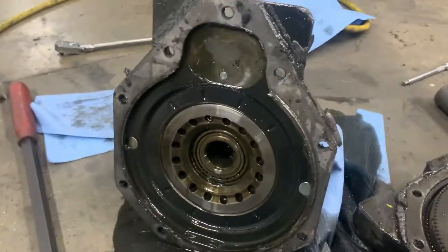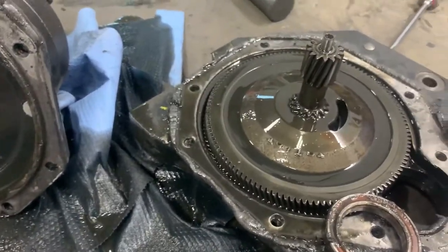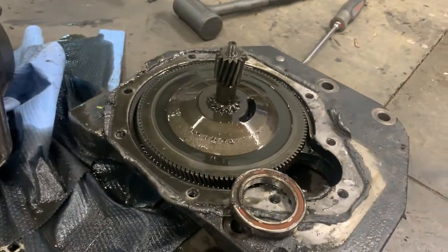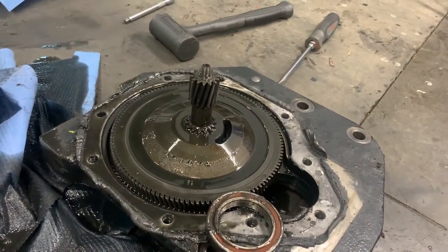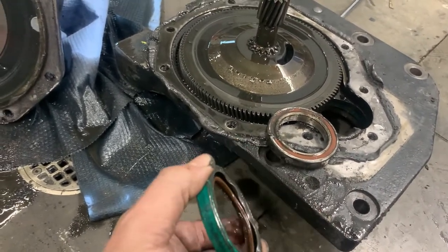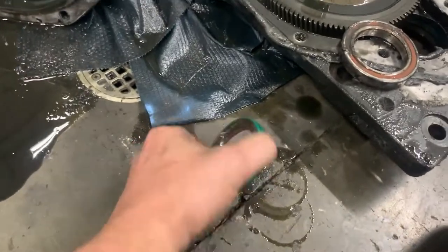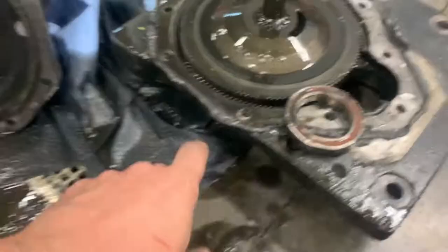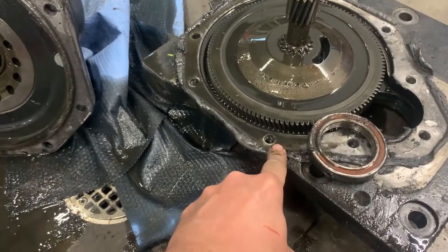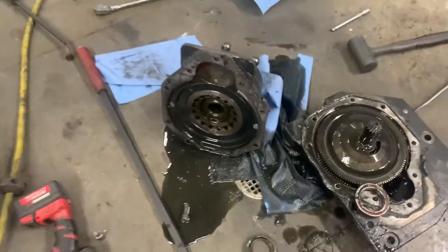Sorry, it's kind of loud in here sometimes. Here's the drive unit — I had to take it apart to beat the bearing out from the other side. Here's the seal; it mangled the seal. So we are waiting on a new seal to come in and some more RTV to seal up this — kind of make our own gasket with the silicone ultra black.